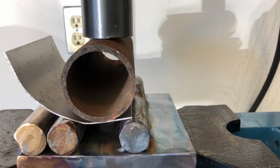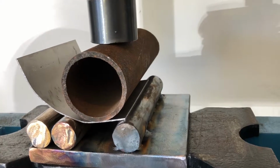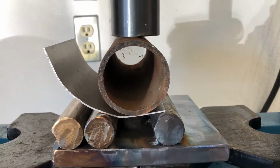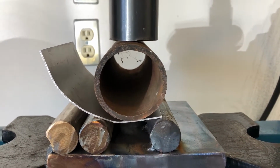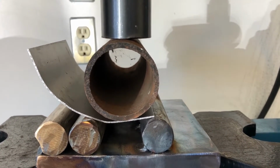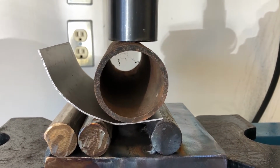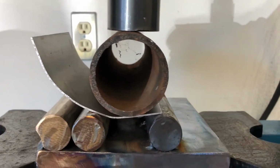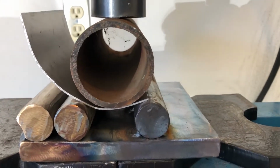So I found another piece of 2-inch pipe. This pipe was in one of the California wildfires, which would be expected to contaminate the titanium sheet with steel. So I'm just doing an experiment to see if I can get the radius I want. And when I do the actual production pieces, I won't allow the steel to contact the titanium. So let's see what kind of a curve we get here. I'm thinking about going down to the steel yard and getting some 2-inch rod.